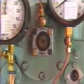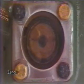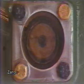Notice the absence of any foam — there are just a few bubbles and those are large. At this point, the oil pump is gas-bound and so is not delivering adequate oil pressure to the crankshaft. The compressor can't recover. If it's run for several minutes at this condition and then the suction valve is opened, we would be loading a dry bearing surface and would cause a failure.